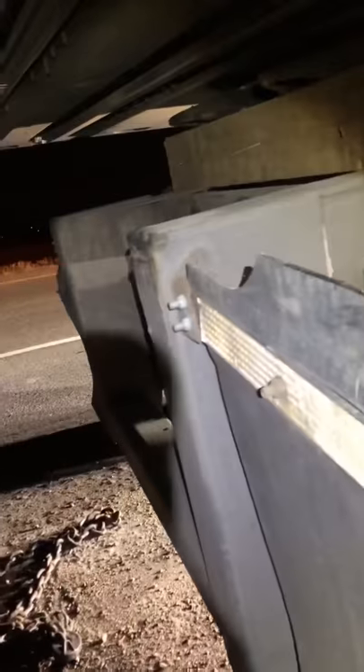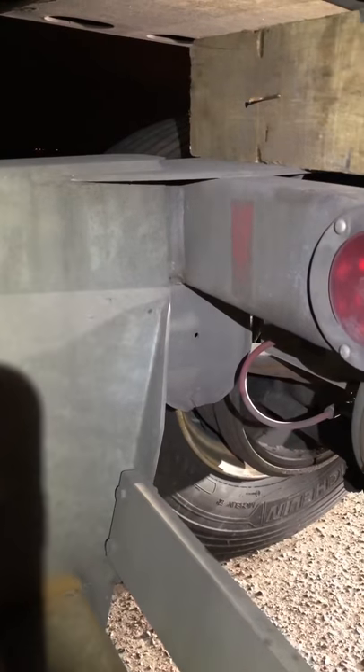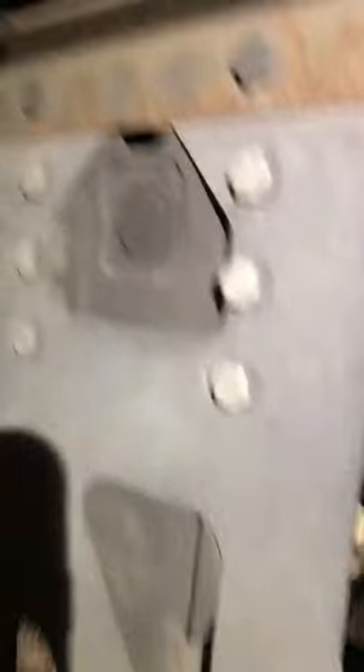We're underneath the front of the trailer behind the con gear. I got my headlamp on trying to help out. I've got two 10-foot chains, two binders, and two short chains. What we're gonna do is come off back here, find a good spot around the back end of the con gear to wrap some chains, and then we're gonna cross the chains - left side con gear comes up to the right side landing gear, right side con gear to the left side landing gear. As we tighten them up we can twist this con gear and get it really straight so this thing tows really good behind us.